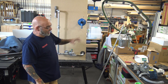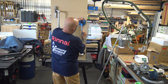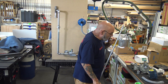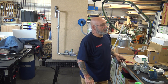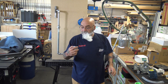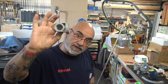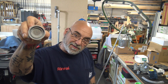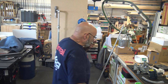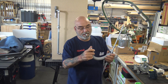Now, we're gonna make believe we're going in the ground because I have boxes set up to make the pipe nice and level for you. Now you're gonna put your pipe and elbow like that. So just say if that was in the ground, you're gonna come up there. Now, you can either buy this, they're about $3.50, $4. It's got a 3/4 inch female elbow with the screen. This is a vent head made. You can buy them, they're like $3-4. And what you would do is put your male adapter in there. Put your elbow.